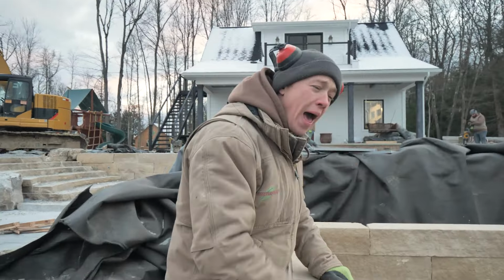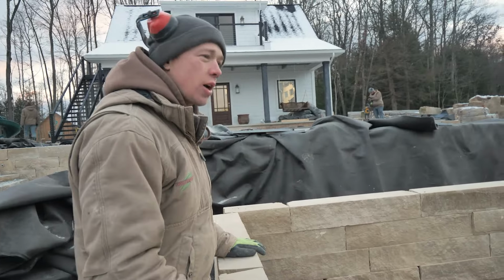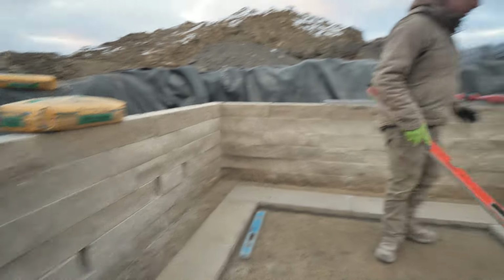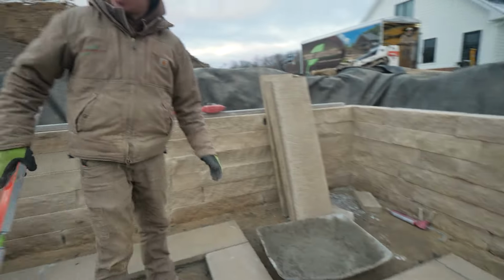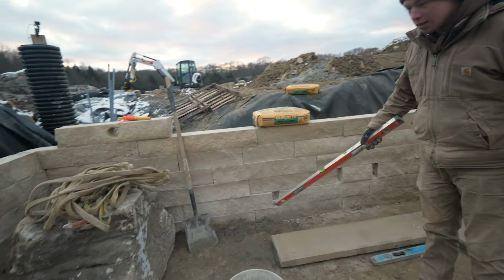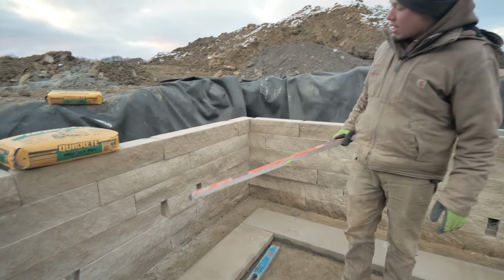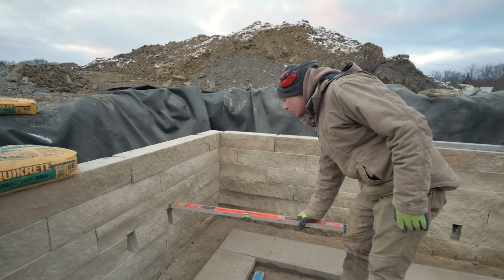There is a pile of stuff packed into this little thing. This is the outside wall. It's going to be two more courses higher. There is a seating wall gonna go the whole way around here. This that I'm building right now is going to be the step system that comes up here. Seating wall is gonna continue around here. Out of the seating wall, there's gonna be suction intakes here. There's going to be lights coming out here, jets coming out here, and then just above, this seating wall is going to be 20 inches high, so something like that.